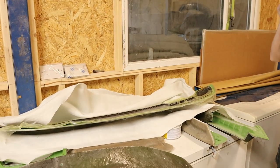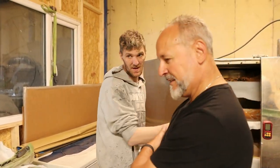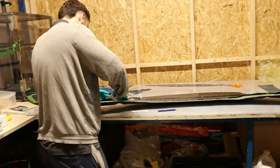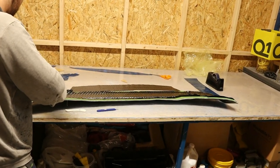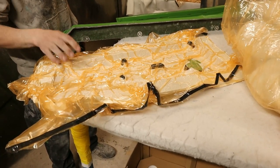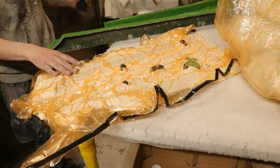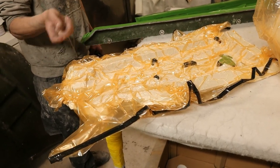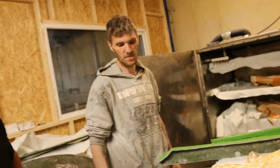It's not a messy job. He's in the process of adding a few more layers to the Lamborghini spoiler. Then you've got to put all your bagging material on - the breather, get it all down, squish it down. And then once that's all ready, you fill it up with as many parts as you can get in there, and then you cook it - plug it all in so it's all sucking down at the same time.